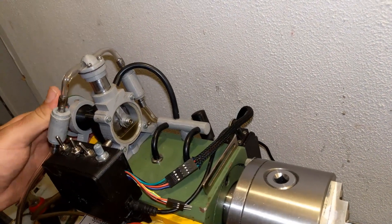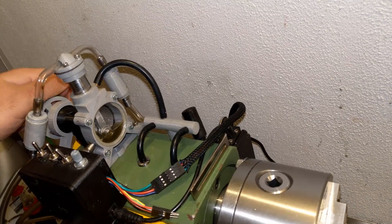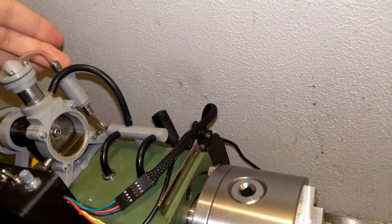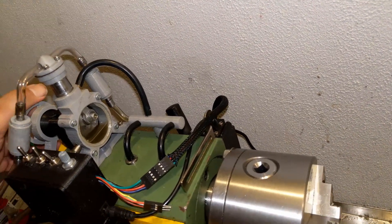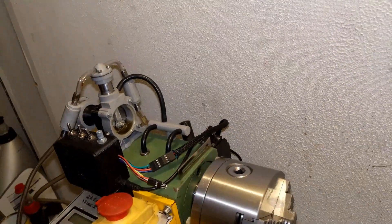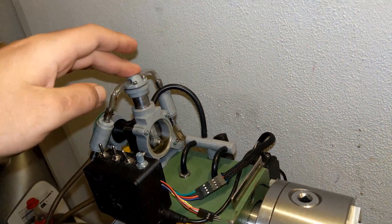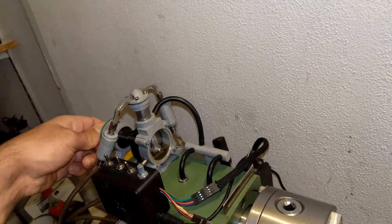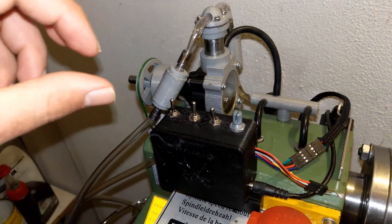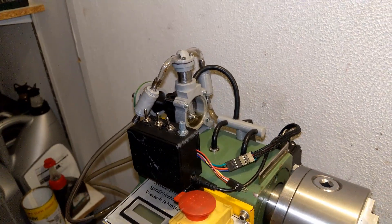As you can see, the oil pools at this point. As it goes up, it pumps the oil and pushes it through the check valve; as it goes down, the oil is sucked up from this point. There was an issue at first — when the pump gets full of oil, it turns slightly tight because of the springs inside the valves, which are quite strong and make it hard to let oil in or out.